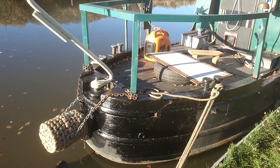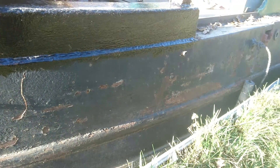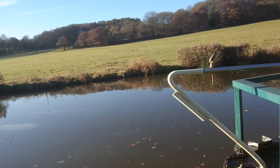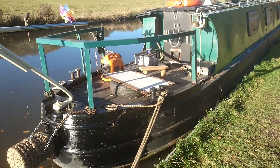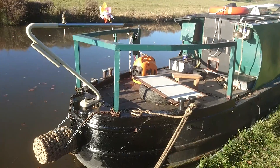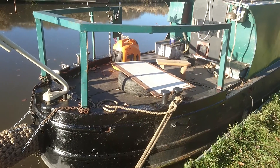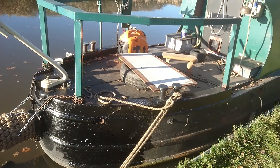It's very slow because the bituminous paint is incredibly thick, the stuff that I use. So you just start off scratching off all the flaky paint all the way down to the end. It's a bit chilly this morning — it looks sunny but it's really cold. And then unfortunately for the rest of it, the boat has to be pulled out of the water, which is quite costly. It costs about £300 upwards, depending whether you're going to do it yourself or pay professionals and whether you're going to hire pressure washers and things like that. But it only has to be done every four years, and ours is a bit overdue, so we need to get it done relatively soon. Otherwise your boat will just rot from under you, and that's not a good idea.